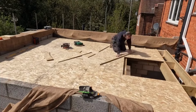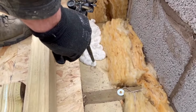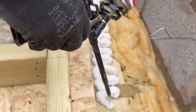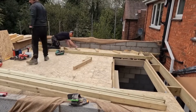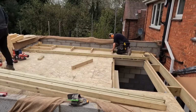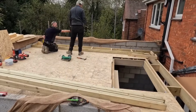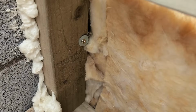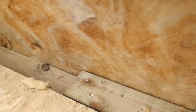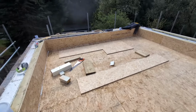Now, all we're doing here is just filling in that roof structure with OSB. That's all it is. Here we're adding a little thermal element to the internal skin, which is going to be timber for our parapet wall, just by laying some foam down. Yes, it's mechanically fixed as well. And then all we're doing here is creating a simple ladder frame, which we will insulate and clad in OSB later on. And this is how we tied our external blockwork into our internal ladder frame: just wall ties built in as standard, and then just penny washed and screwed through.